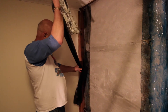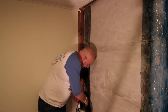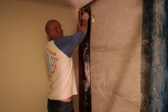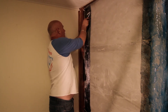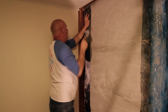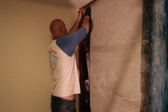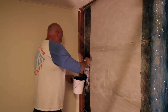Now that we've got our primer set up, we're going to thread this piece of Kevlar through here past this electric line and put it up on the wall. In this kit comes a handy little roller, and what we're going to do is make sure that this strip is on the wall nice and flat. We'll use this roller to secure it and get all the air bubbles out. Once it's secured, we put our top coat on there — and I go liberal on this stuff.